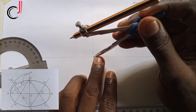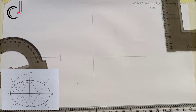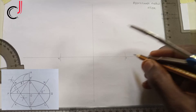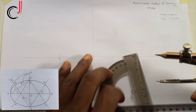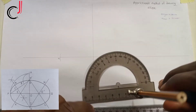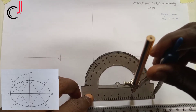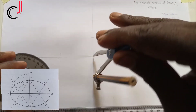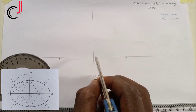We place the measurements at point O. We mark the endpoints of the major axis as points A and B. Then we take our minor axis which is 60 millimeters — 30 upward and 30 downward — and we call these points C and D.